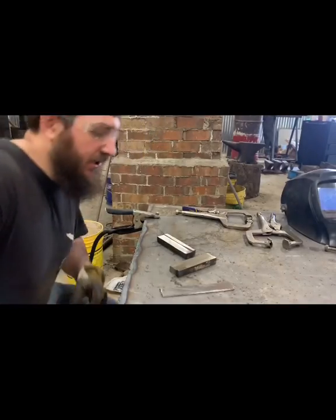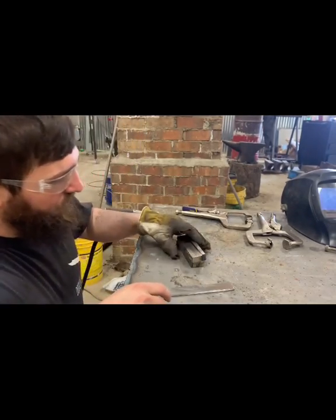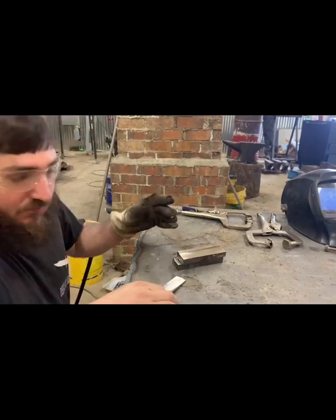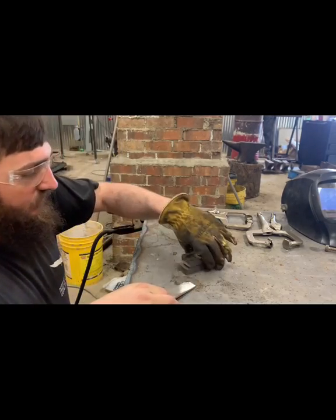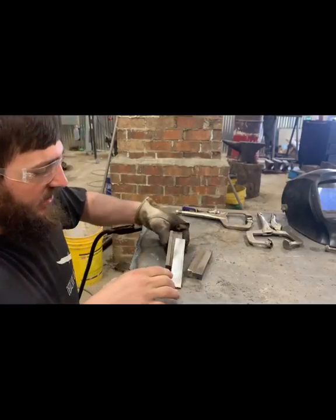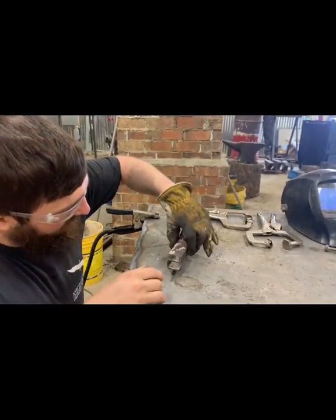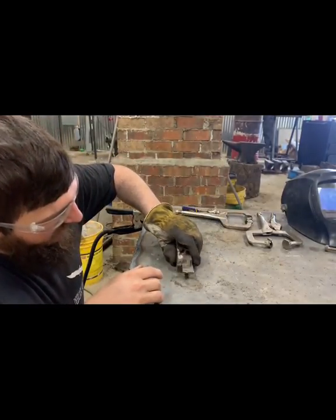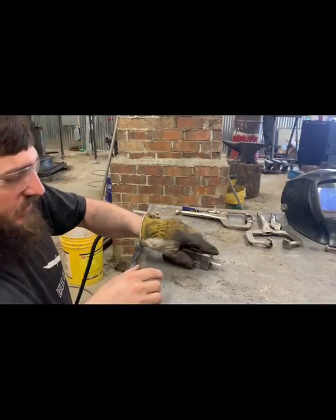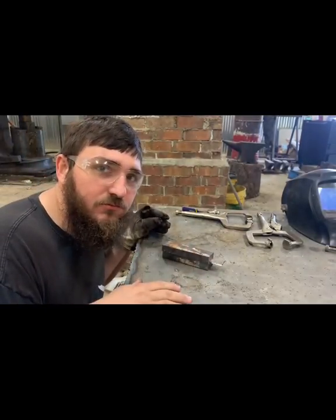All right, so here's what I did. I got that piece of Damascus we talked about a while ago cut up, and I got my core. Now what I did, and I've never done this before, but I know it's gonna work, I cut a groove down through here. So that'll set in there. And this piece will come and sit right on top like that, and it's locked in tight. That way on the spine of my knife, I've got nice, even, beautiful flowing pattern welded steel.